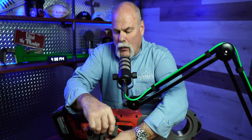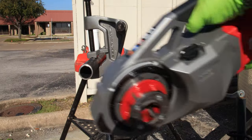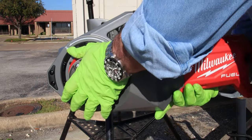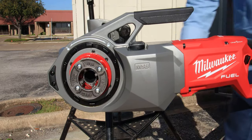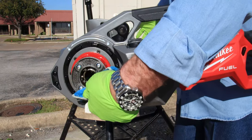This is the support arm, and what I love about it — I used the worst tripod vise I have because I wanted to see how well this works. When you clamp this onto the pipe and slide the tool right where it goes, the support arm holds it and leverages the clamp, the pipe, and the tool together so it doesn't try to twist on the tripod. Literally, I went out by myself — nobody to hold the tripod, nobody to hold anything — set it up, locked it in, and it worked great.